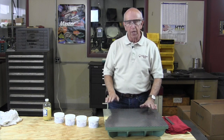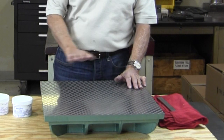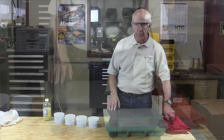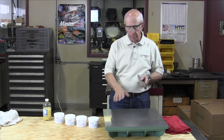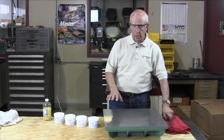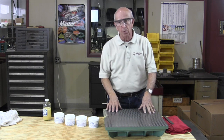What I like to do is start with a good lapping plate. This particular plate has been ground flat within a couple of tenths. You are not going to get a good flat surface lapping something if the lapping plate has a bow in it, or if it's high on one side and low on another. So you've got to start with a good foundation — a good lapping plate — and that's what we have here.